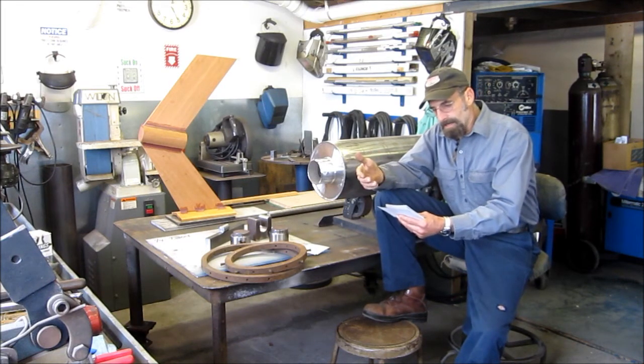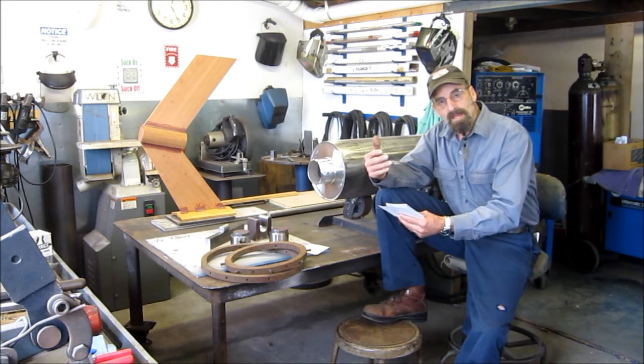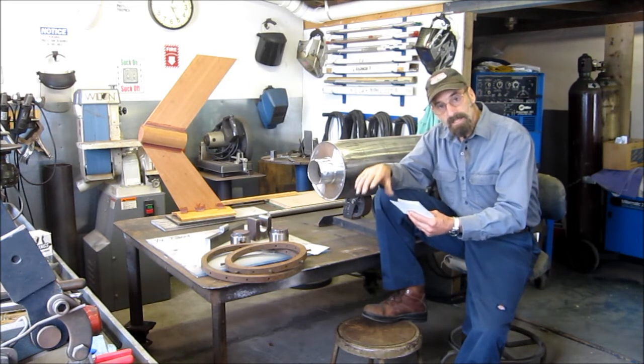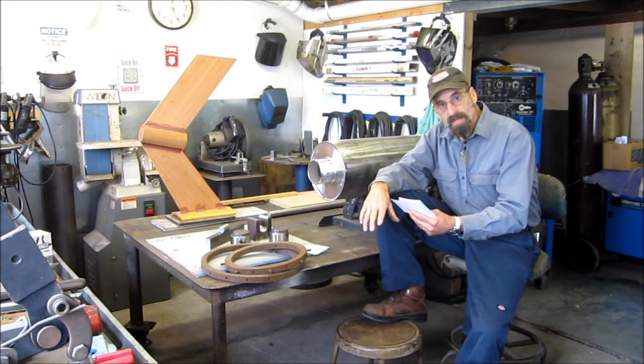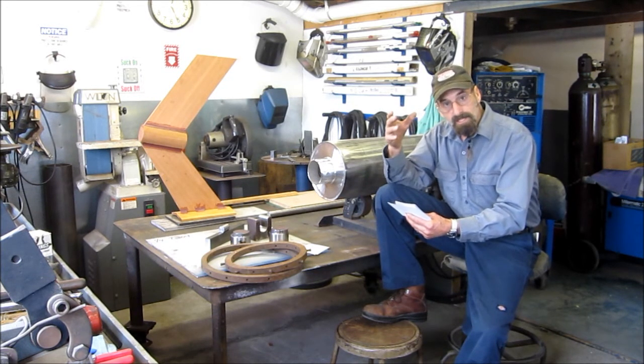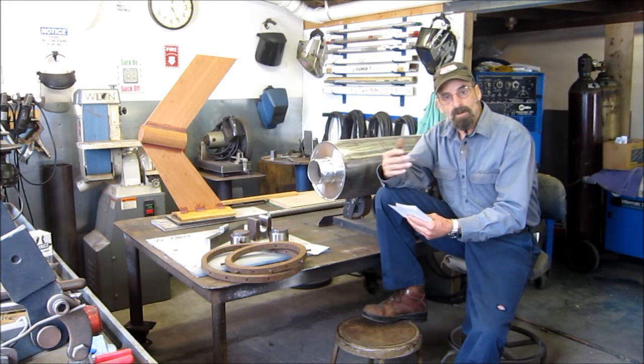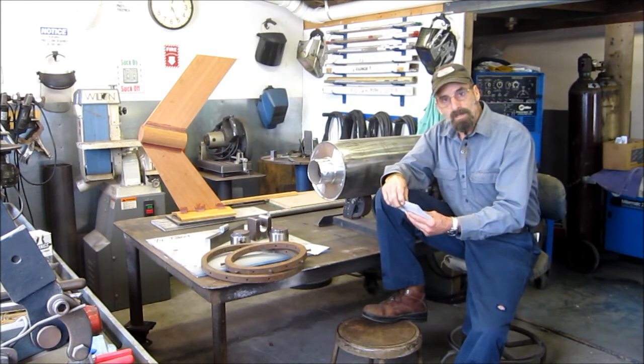The plug is in the receiver there and you can see the four lugs that are welded, drilled and tapped. I made a square base that actually sets down into the bottom of the keel area and is securely anchored in there. Then the mast will slip down into there and the four bolts — I think they are one inch bolts — actually bolted the base of the mast down.